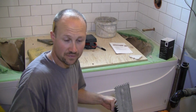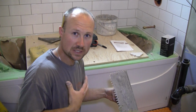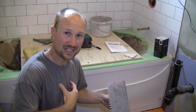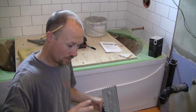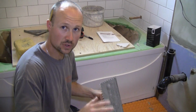One, it helps with the holding power so that when you set your tiles in, they don't sink. The biggest one I find is for your lungs. Silica sand damages lungs, and that's in most mortars. With this, it doesn't get in, because silica sand will get in and actually stick, whereas this is just plain dust, blow it away and you're fine. So the mortar I love to use is definitely Trio. Use them all, it's a great mortar.